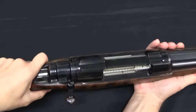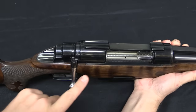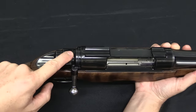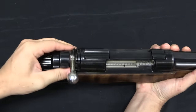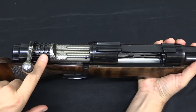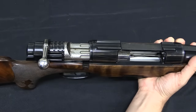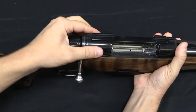Now we can see into this action. The big question is how do you rotate two bolts at the same time, presumably in opposite directions? The answer is: you don't. We are all used to front locking bolts — lugs at the front — because those have certain advantages for machining and action strength. But with rear locking lugs you can easily make the action a little bit stronger to accommodate that, and rear locking lugs have other advantages when you have two bolts. What Seke did is a six-lug design — three on top and three more on the bottom — basically a rotating collar at the back of the bolt assembly that locks into the receiver. This means the bolt heads don't have any lugs and don't need to rotate, allowing a much simpler system at the front, which is ideal for a double-barrelled setup. When you rotate the bolt down, those six lugs engage at the rear and lock the whole thing up very nicely.